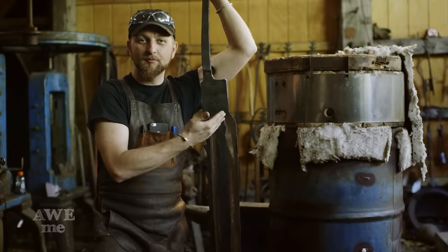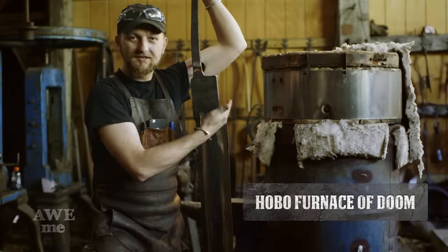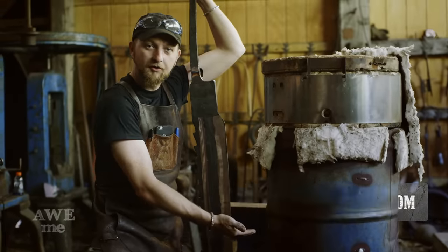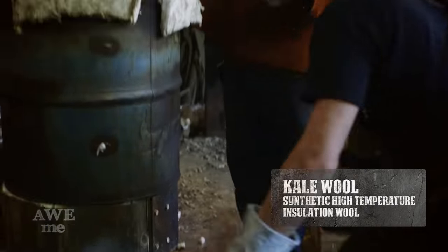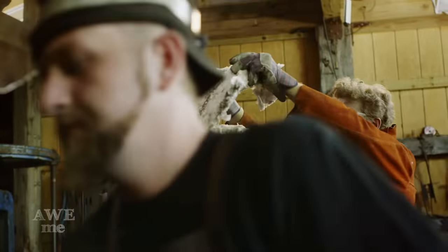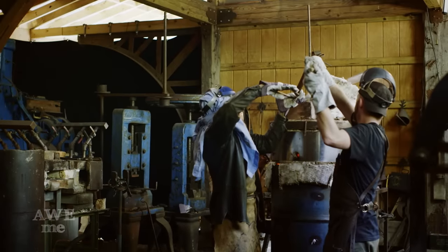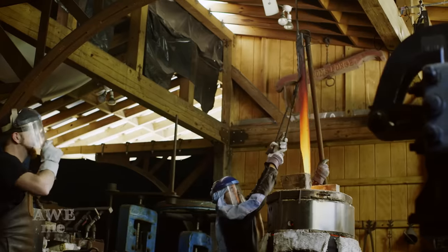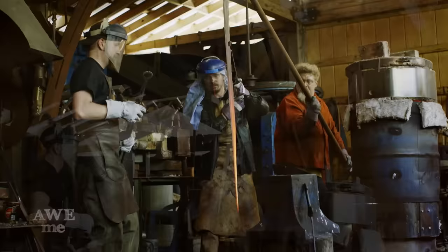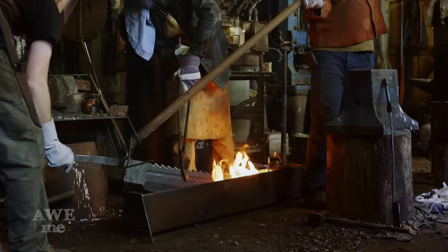Once again we're breaking out the old hobo furnace of doom for this heat treat. Basically what this is is a couple of electric kiln rings with a kaowool lined barrel. We're firing it with a giant weed burner powered off of propane — it gets plenty hot. It's gonna heat up to about 1550 degrees in about 10 minutes. Our goal for this heat treat is just to get the edge heat treated, so we're gonna heat that up, quench it horizontally, and let it sit there and burn out for a while because it's gonna flame big and it's gonna flame for a long time.